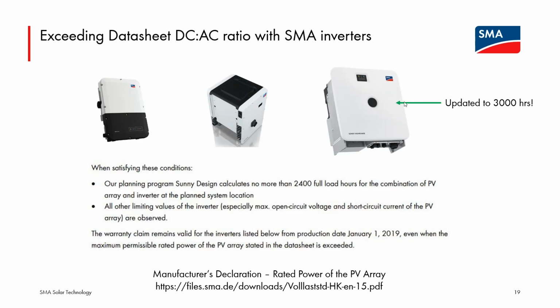Again, there's the 3,000 full load hours. If you have any questions on this process of wanting to go past the datasheet DC to AC ratio, feel free to reach out to anyone at SMA. Again, you will have to actually construct within Sunny Design the system you are intending to build. Not only will it output a certain number of kilowatt hours or megawatt hours per year, there is also this metric of full load hours that it will export for that specific design. And that is the metric you need to look at if you wish to exceed the DC to AC ratio on the data sheet of the device.